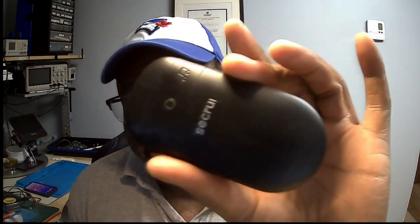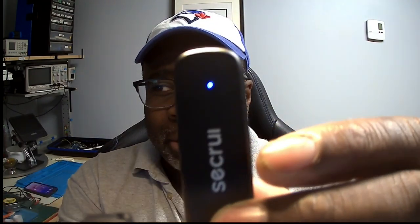It's a very small device. Here is the actual receiver and this is the sensor. You get two sensors. The idea is that you have a magnetic reed relay — this is actually magnetized, you can feel it. You put one in the door or the door jamb, and then when somebody opens the door, bada boom, it gets tripped and goes off. You can see the light just came on. So that's how it knows somebody's opened the door, and then that sends the signal down to the receiver, which you plug into your normal 120 to 115 volt system, and it sends out a chime to notify somebody's opened the door.